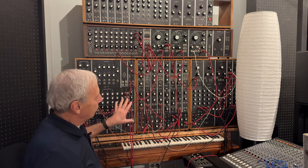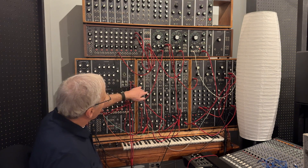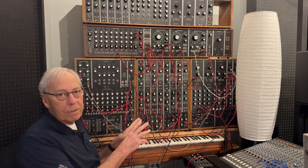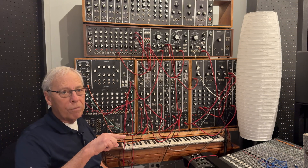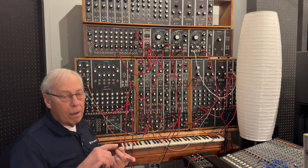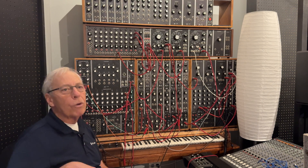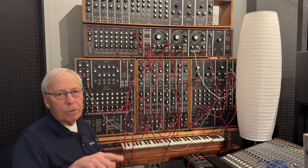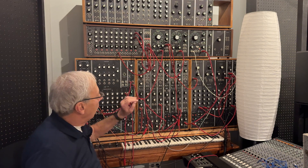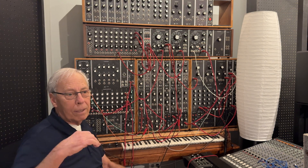A synthesizer like this is an old-fashioned synthesizer — the original made by Robert Moog — and you'll see it has all these modules and all these patch cords. The idea was that you could patch everything together to make it do what you want. Everything in this is voltage controlled, which means that a control voltage changes the parameters of each of these modules. The main modules are a voltage controlled oscillator that makes the sound, a voltage controlled amplifier which goes up and down in volume, an envelope generator, and critically important, the filter — there's a voltage controlled filter — and that makes the character of the sound.